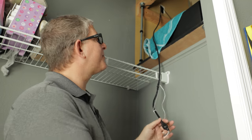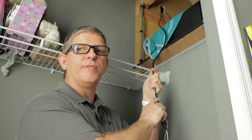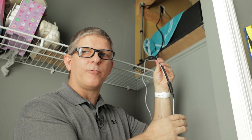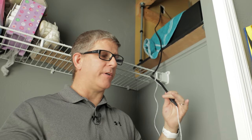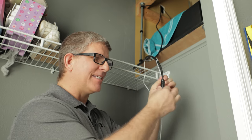Here we are on the back side of my home theater. You can see the original thick HDMI cable — we're going to be removing this. You might wonder why we don't just tie the new one to this, but getting the old one out first will make pulling the other cable much easier. I don't have conduit — if you're building a new home theater, I'd recommend using maybe inch-and-a-half or inch-and-a-quarter conduit, whether PVC pipe or flex conduit. That would make this process a lot easier.